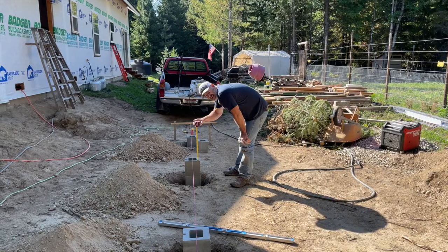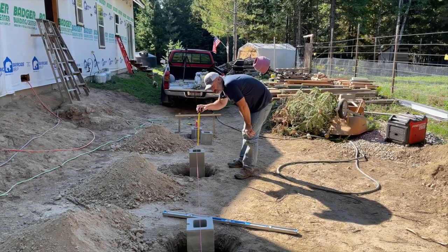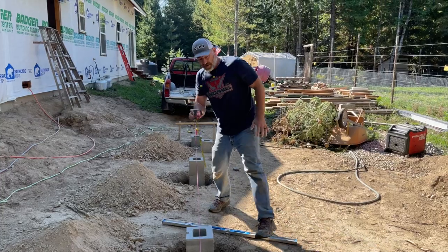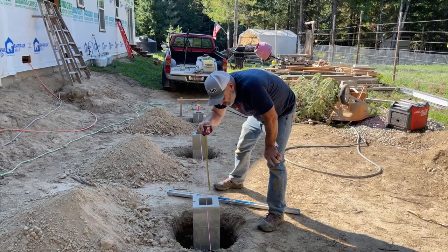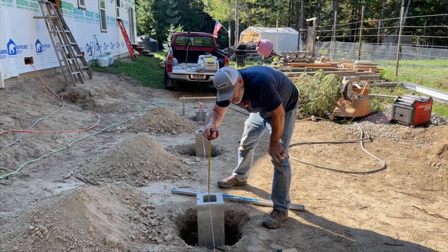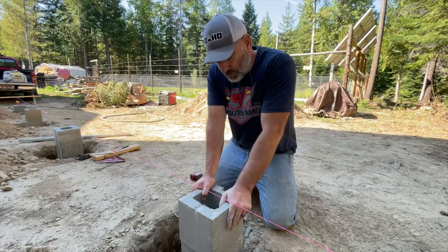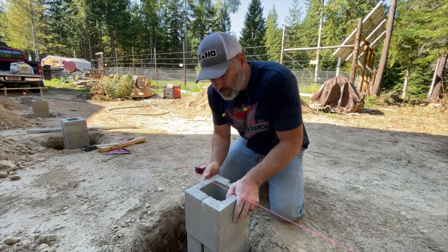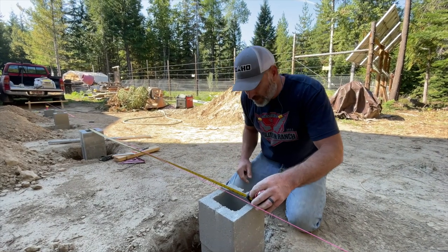All right, so this one right here is gonna be our standard, and it is 2 9/16 away from the string. We went ahead and cut this one without showing you guys because it took forever to figure out, but this one is now 2 9/16 from the string. So now we'll show you the process. First of all, we're gonna get these guys where they need to be distance-wise. Posts are 7 feet on center. Needs to go that way, 1/4 inch.